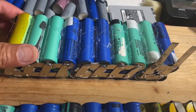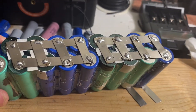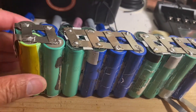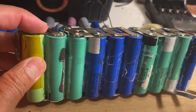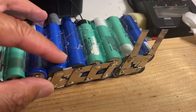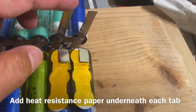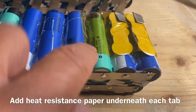Here's what the battery pack looks like after I solder each of the packs. I decided to build two 5S packs and then connect them in series to make a 10S pack. What you see here is four individual cells hooked up in parallel, and then each of the four cells are connected in series to make a 5S package. I have two of these, and the other 5S has tabs which will allow me to connect them in series to create a 10S battery pack.